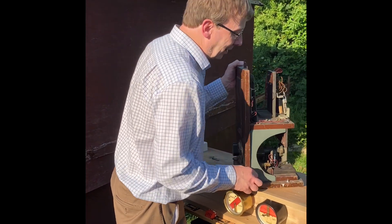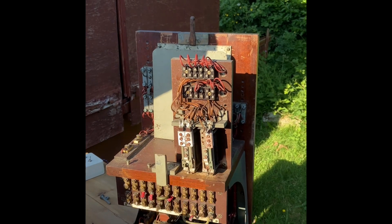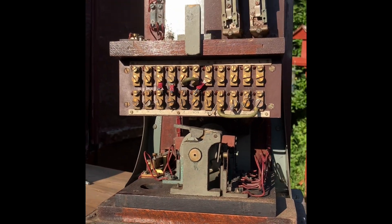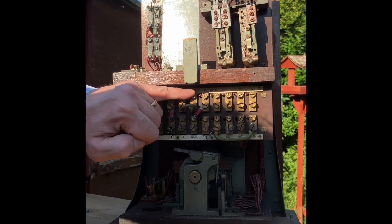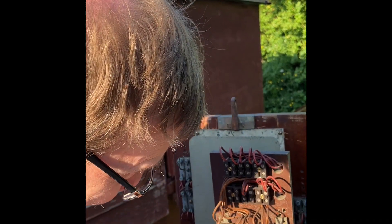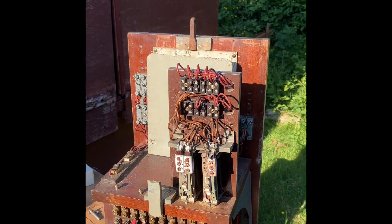I don't know where this one is from, alas. It gets better — it has one LCS and one BCS, so it had Welwyn control. Some of the metalwork is turning green but it's still a very interesting instrument. Looking further: CD contacts are actually not shorted, EF are shorted — so no track circuit control. And the Welwyn control, I think, is shorted out too, though it's not easy to tell given the condition. I can't see how you could have Welwyn control shown if there was no track control — so that's a very interesting instrument with several layers of history.